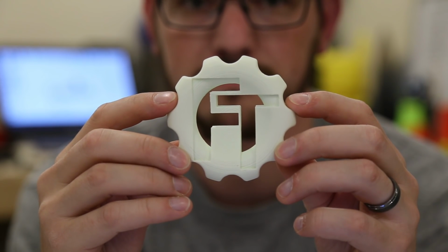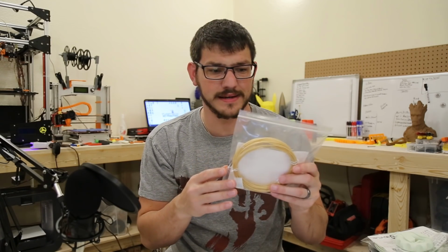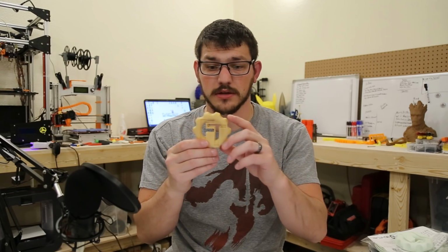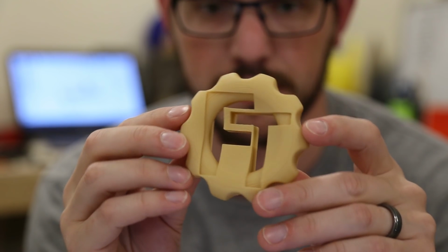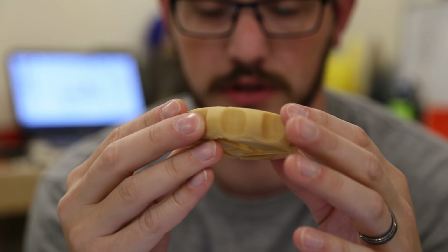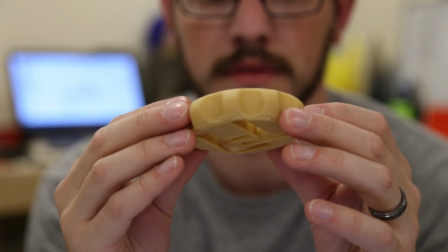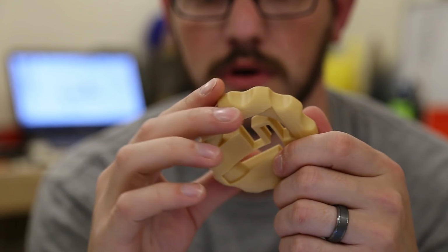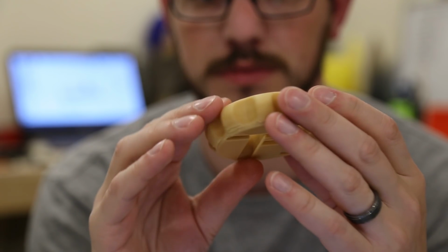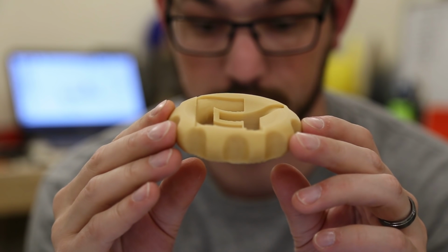It's not too bad. Up next is the PLA PHA from MeltInk, and this is kind of like a sandy color to it. And here's the print. So let's take a look at it. So this is the PLA PHA, and when I said that the glass-filled PLA was smooth, this takes the cake. This is super duper smooth all on the sides here. I mean, I've actually never had something feel this smooth before. The top layers are gorgeous, absolutely gorgeous.